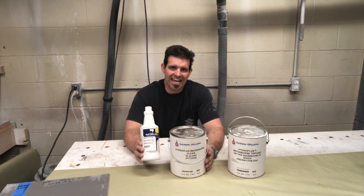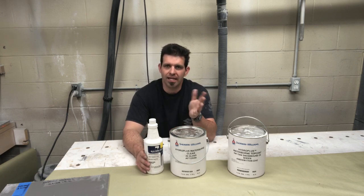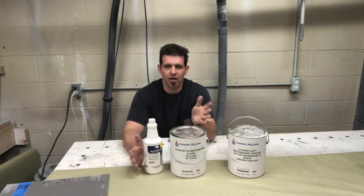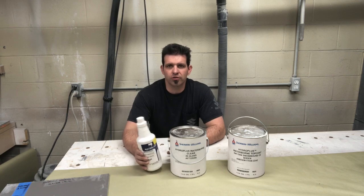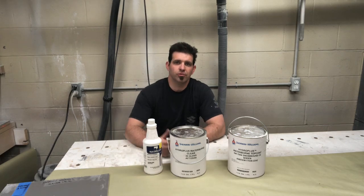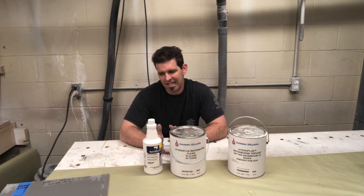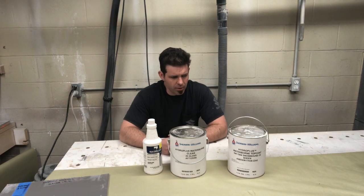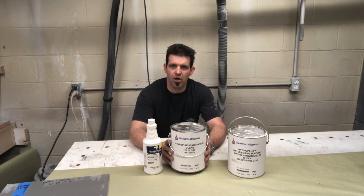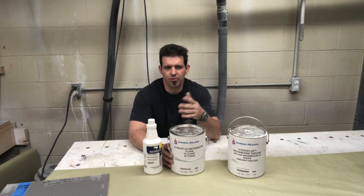The Crosslinker is $70, however you can do 25 gallons with it. The way you mix it is kind of unusual — you take 50% distilled or deionized water and mix it 50-50 up to about 1%. Adding more Crosslinker doesn't help at all, so you're going to get what you saw. The chemical resistance is pretty good. The mar resistance is super excellent when you add that Crosslinker. By itself, not so great. But it shoots really, really well out of air-assisted airless, and it has a really great hang time — you can hose it on and you don't get runs.